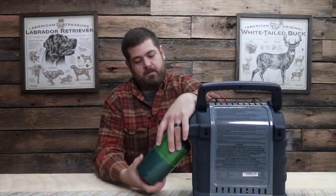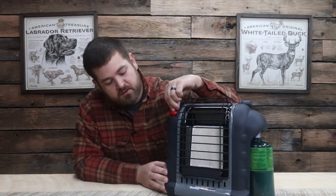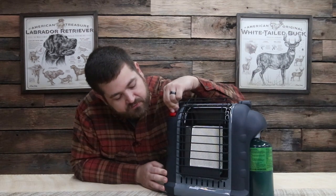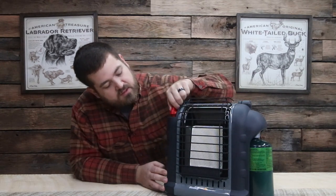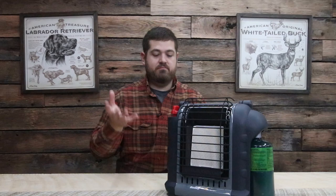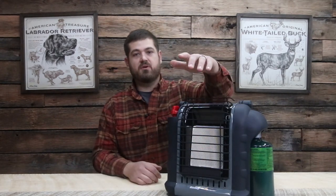There you go — finally got it. Now you've got your propane tank on. Switch it over to pilot, push down until it catches light, hold on to that. If the pilot stays on — which it is — you switch it over to low, and the front of the furnace will catch light. It holds right there on that white section. When it's cold outside it turns red and you can see the heat coming off of it.